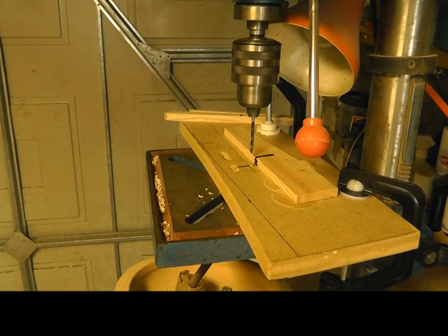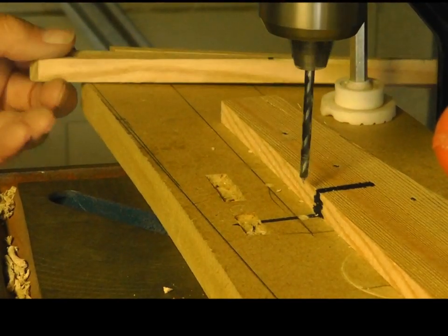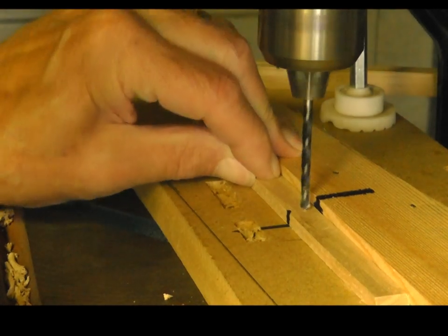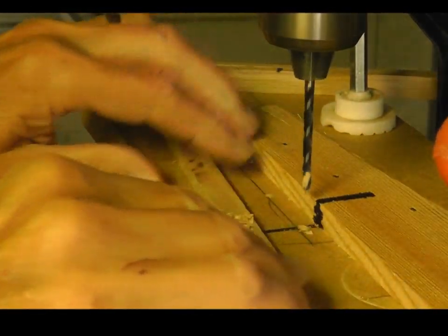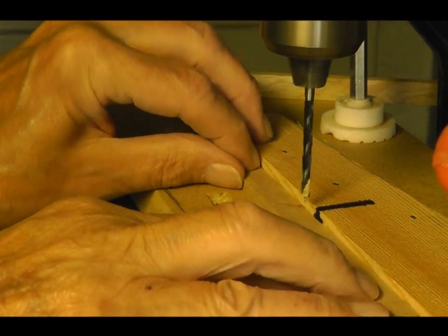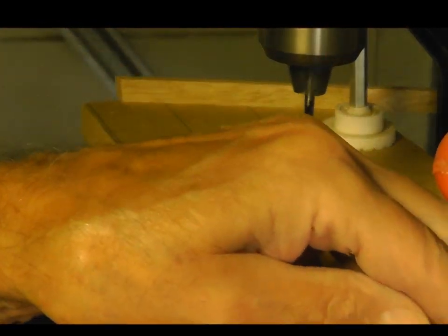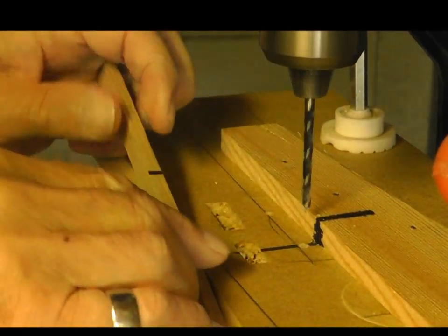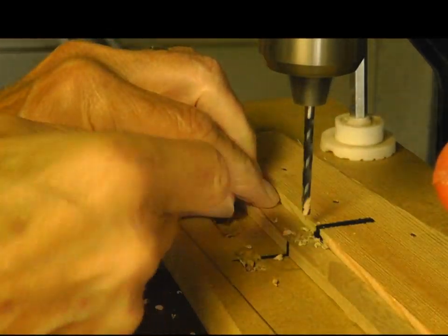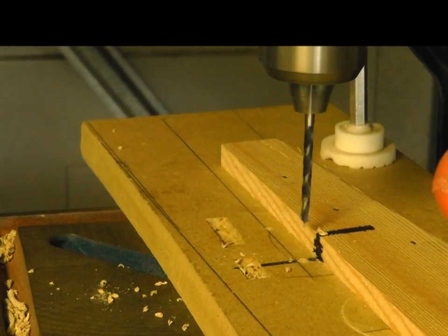Here I've set up a jig in the right place underneath the pillar drill, so that when I line up my piece of wood I line up this mark with this mark and bring the drill down, the hole will be in the middle. I'm only doing two or three pieces at a time, because if I take too many out and lose the sequence they're in, it's very difficult to try and get them back together again. So that's the sequence for drilling the hole into the middle. The bit, by the way, is a proper wood-turning bit — it's not a metal bit.